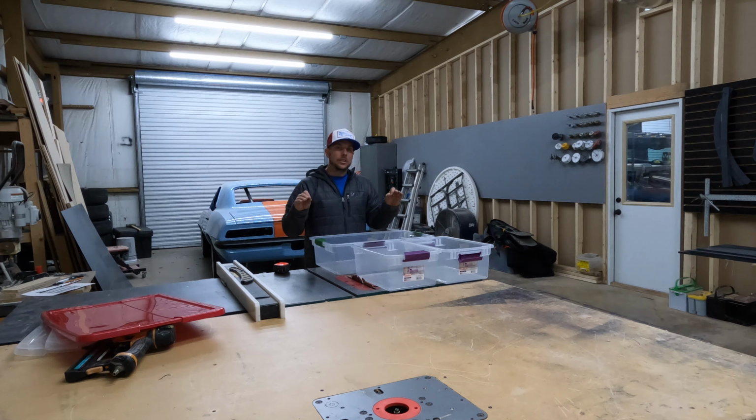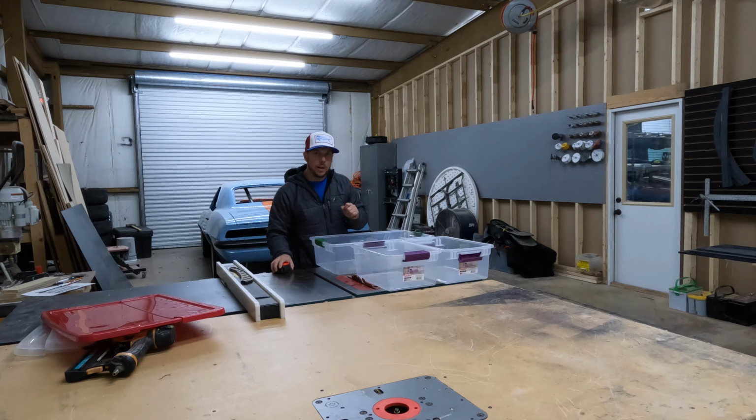And we're going to dado each one of the shelves into the sides that I just previously cut. So you need to figure out what depth your dado is going to be. The material we're working with is a half inch. It's actually 12 millimeters, which is a little bit smaller than a half inch. So make sure you calculate your measurements. I believe I will dado at an eighth or 3/16. So let me go over here and check this real quick, and then I'll let you know exactly what I'm going to do.